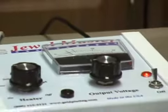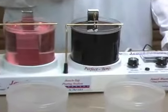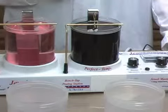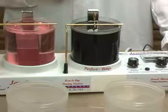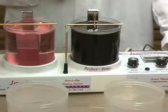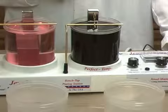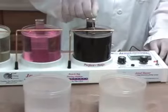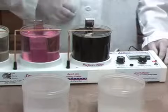We are plating these coins for a total of 3 minutes. This will produce a good decorative gold thickness of around 15 microinches. The plating time can be measured with a timer or by watching the second hand on a wall clock. After half of the plating time has elapsed, the rack is rotated so both sides of the parts get equal exposure to the anode.